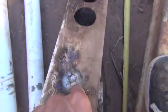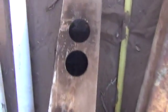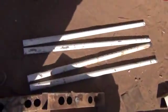We've got our baffles welded into our square stock. There's the one on this side, and there's the one on this side. That one had twin baffles — that was a design hole pattern on that one. This one here had a single baffle right there in the middle. How I did that was drilling holes on either side so I could see the edges, then welded it into place from there. So if you can't get your welding head down in there, use that method. We've got all our baffles into place. We're going to grind now, clean up all our edges, and weld this radiator together.